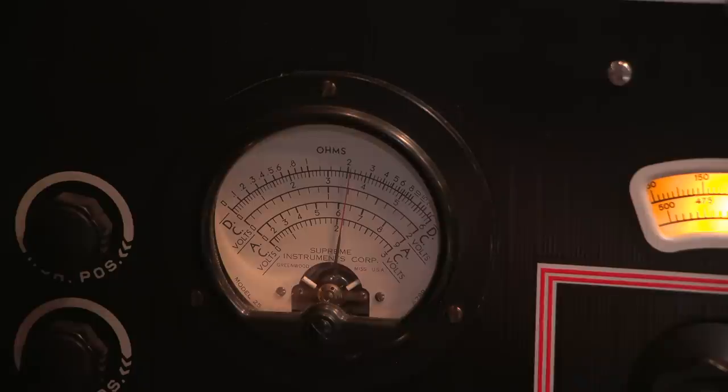And as you can see, a little bit over 200 ohms. So the next line up is 225. So I'd say maybe 215, something like that. 210, 215 ohms, absolutely fine. Now, being incredibly accurate and knowing this out to 214.8 is not needed in equipment like this. So that's absolutely fine. No problems. That resistor's good. Let's see, what else can we check?